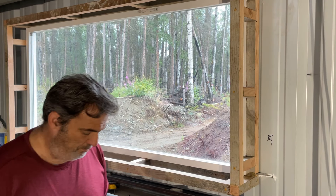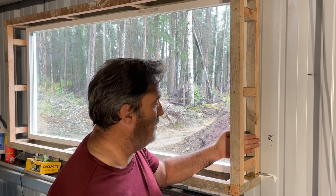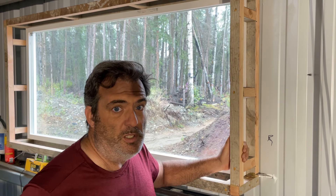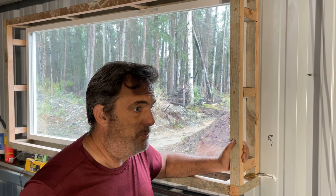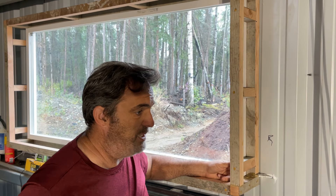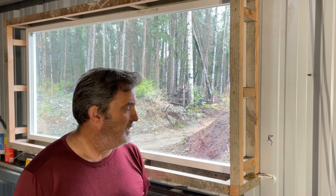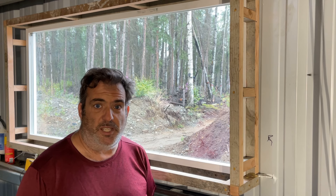As you can see, we're about eight inches deep — within a quarter inch of the outside of the girt. With four inches of foam, it'll build up to about here, putting the glass unit pretty close to dead center in the insulation portion, which is where you want glass. A lot of windows get pushed out to the very edge of the wall, but they actually work better centered in the insulation package. This will get furred in, sprayed, and sheathed with three-quarter inch plywood so I can attach anything to the wall anywhere I want. Not bad for a proof of concept — taking old 2x12 concrete forms and turning them into something usable instead of scrap.